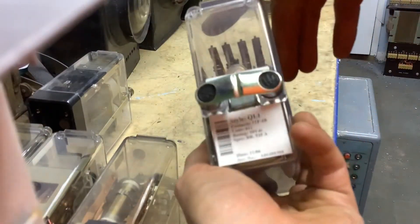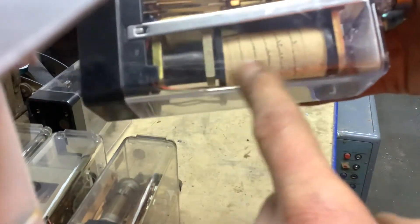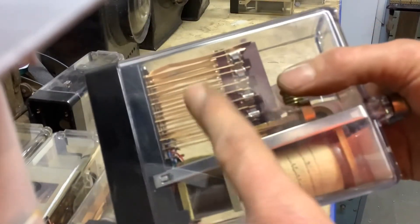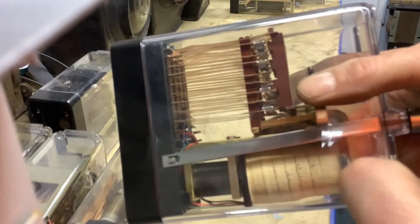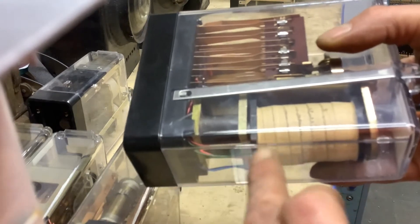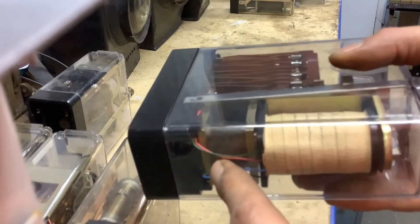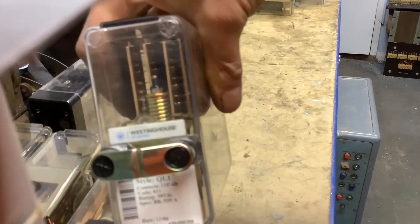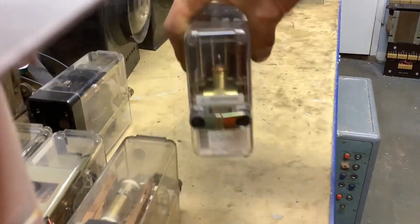This is quite an interesting one — there are two versions. The giveaway is the L: it's a Q style L, a latched relay. You have the pickup coil but also a de-energising coil. There's a permanent magnet inside, and once this relay is energised it will stay in that state even when you unplug it. So when you come to change and replace them, you have to make sure they are in the same state as the one that came out. There is a de-latching circuit — an extra coil wrapped around the soft iron magnet — that destroys the magnetic field of the soft iron magnet so the relay will de-latch and can be driven down. These are very similar to the polar neutral relays from the shelf-type relay series. It remembers the position it was last in.